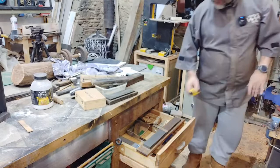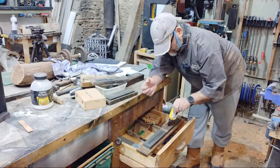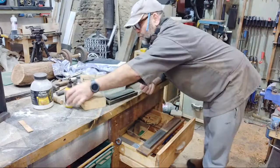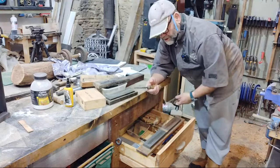So this is actually just engine oil and a bit of white spirit mixed together. That's all I use. What that does is it lubricates the actual tool, helps prevent the tool from getting rusty. That's one of the reasons I don't like using water, because some people use water or Windoline for sharpening the chisels on a diamond stone. You wouldn't do that on stones like this. These have to be done with a thin oil, like 3-in-1 type oil. But I just use a bit of engine oil. It's only a lubricant for your blade to swipe back and forth, isn't it?